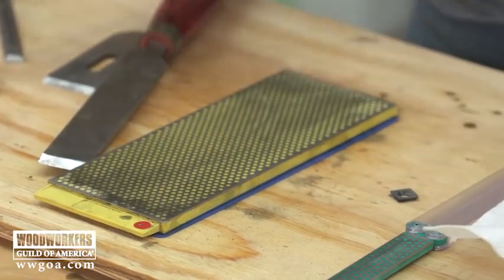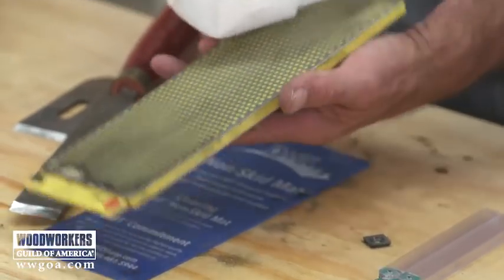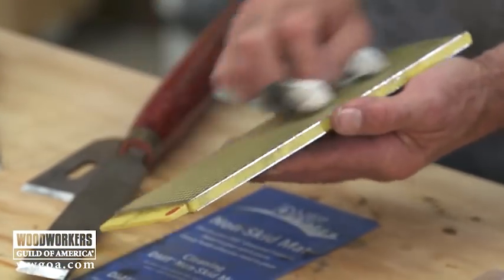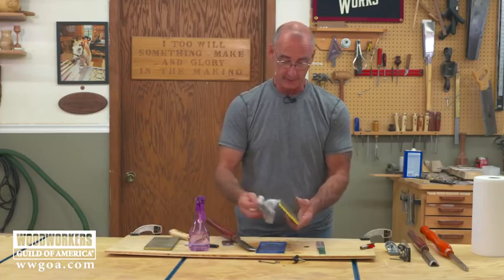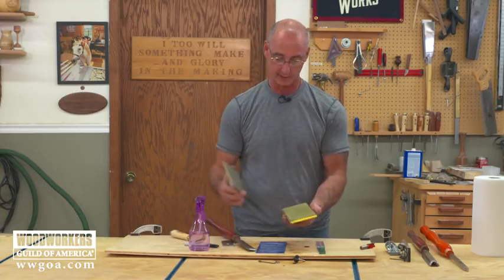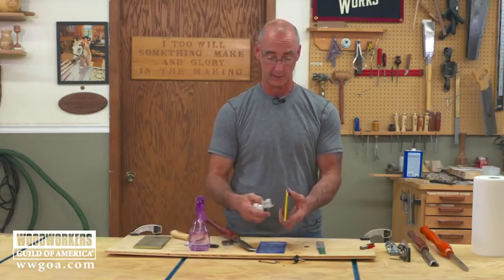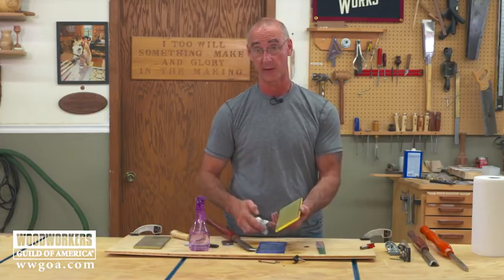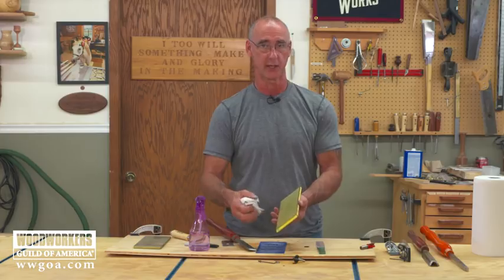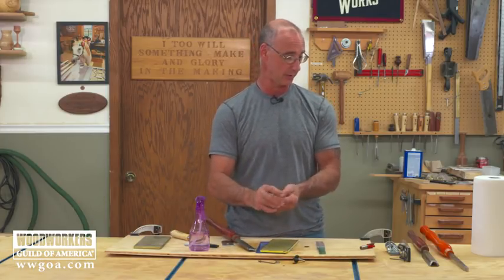When we're done, a little bit of water, a wipe down, and our diamond stone is nice and clean. Depending on where you need to start, diamond stones are available in a variety of grits. If we're taking a nick out of an edge, you're going to want to start at a coarser grit and then work your way up to a finer grit. If you're simply honing and refreshing the edge, you can go right to the finer grits. But if you've got to do a more aggressive cut, start with that coarser grit.